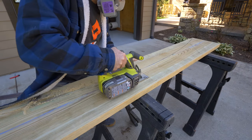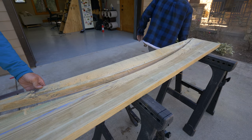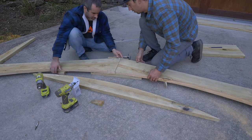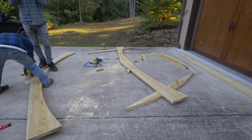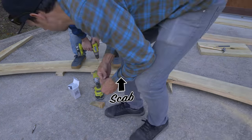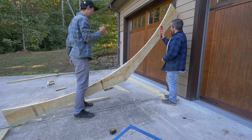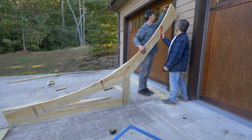This transition is just mellow enough to cut with a circular saw, which makes for a really smooth cut. But since we're using 2 by 12 lumber, we'll need to join a few pieces together in order to make it a full 6 feet tall. To join the sections together, we line them up very carefully and use a scab — just another piece of wood fastened to the outside of both pieces. Once we actually install this lip on the trail, it'll include additional supports at this junction to help support the weight of the structure and the people riding on it.